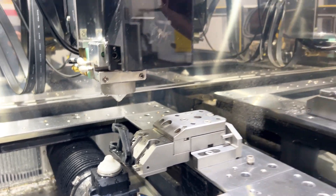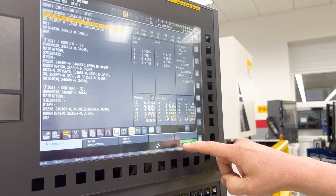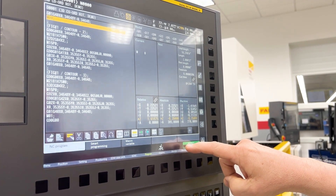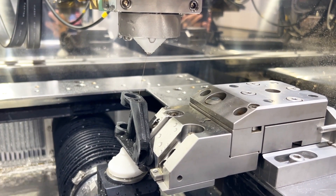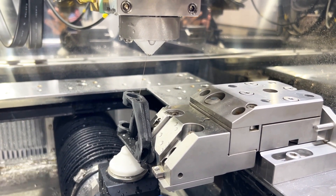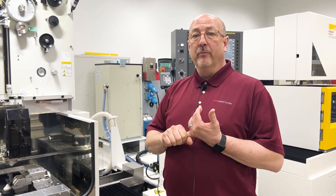You can see on the screen that as the wire goes around, we don't have any solid shorting going on — we do have some touches because it's a casting. I just ran three passes on this to make sure I'm going to get a nice clean finish on the bore. This feature works in manual mode.